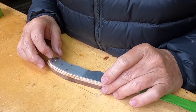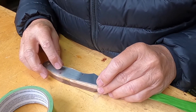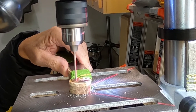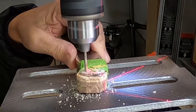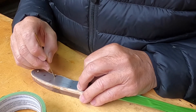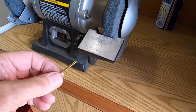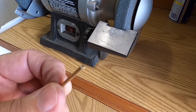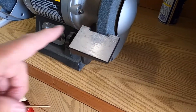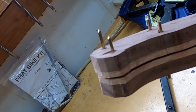Here's what's going to happen — I'm going to hold this blade right down here with a few pieces of tape so it's exactly where I want it. Then I'm going to put it up on the drill press and drill through all six of those spots right there. Once I have that done, I'll do the same on the other side and these little pins will be able to go right through there. I'm going to use the bench grinder to grind a nice little round point on all these pins — that'll make them slide through that handle a lot more precisely. I've got a test fit going, and I'm going to take it all apart and slap all kinds of epoxy in there to hold it all together.